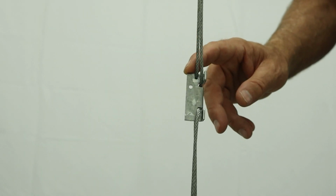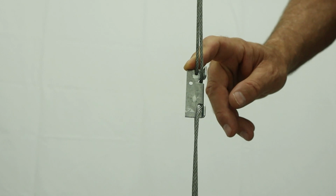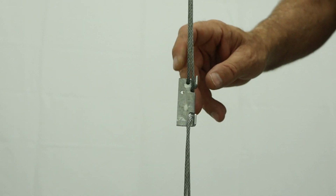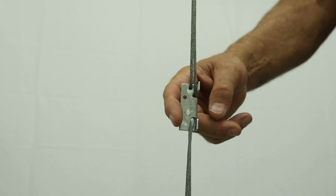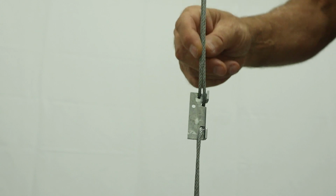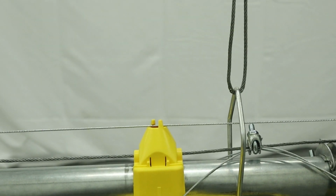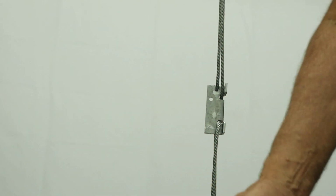In your winch system, you're going to need to make individual level adjustments for each drop cable. So we're going to use the Valco cable clamp, which is adjustable. In order to put this on, you're going to thread your drop line through the top hole, down through your hanger, and then thread it through the labyrinth here to get it clamped tight.